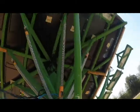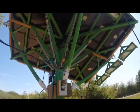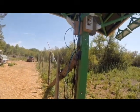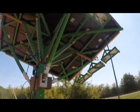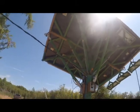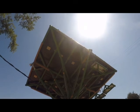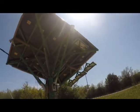After getting it all together and making the whole post, I put it here because this is the only place that doesn't get shaded by the trees. The post is extremely sturdy — set in gravel with a big support on one side. I put long boards on each corner to keep it stable. It flipped over three times onto the ground and never dented or weakened it. I cut 45-degree supports and set them in without even measuring, but they're all identical — giving the middle structural support in eight different places.